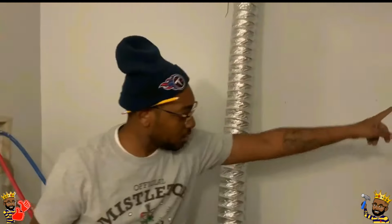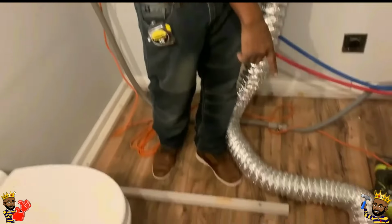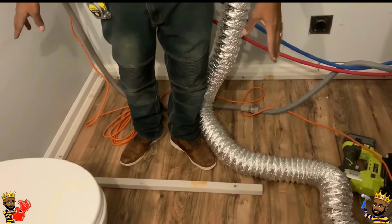Framing this area out. My back plate, bottom plate against the wall. Yeah, I attached the studs. All of these are on 16. So, I already marked my studs out. These are going to be cabinets and shelves and hangings and washing cups and all that. But this is going to go here. Like I told you, this is 38 inches. It's going to come across here, connect right in between.